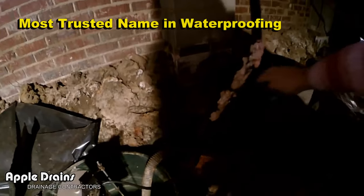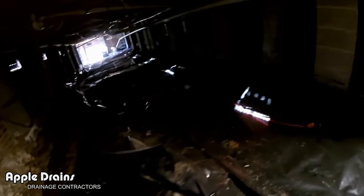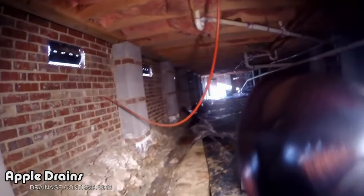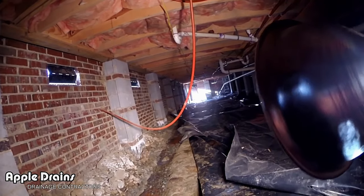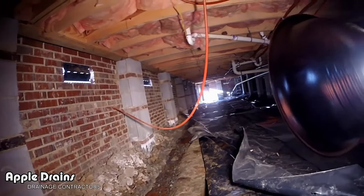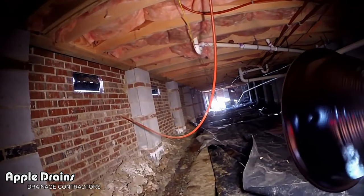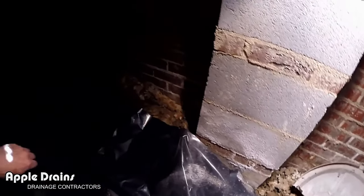What happens with this type of installation — you can see the water over here. Let me put some light on there. You can see water just laying in the trench, so they really did a bad job, to put it bluntly. The dirt is mounded up on the side here and should have been graded out. Water just extends all the way through, and moisture is getting up into the house — they run the risk of termites pretty bad.